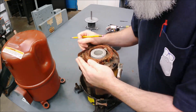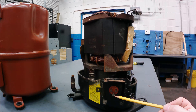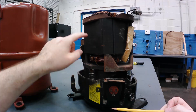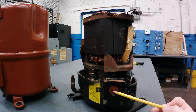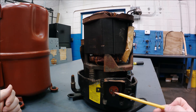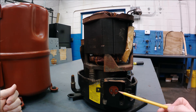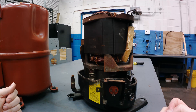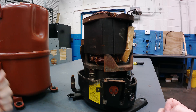Now when we look at the terminals, we have one, two, three terminals. These are not three individual windings. We have a run, a start, and a common terminal — three terminals. We don't have three windings. We only have two windings, but they meet on one end and join together, and that's the common terminal. Don't go calling it three windings — I know some 20-year guys in the field that call it that. It's not three windings, it's three terminals. If you want three windings, you've got to get a three-phase. Run, start, and common terminal — but there's only a run and a start winding. They both meet on the common end, and they call that the common terminal.